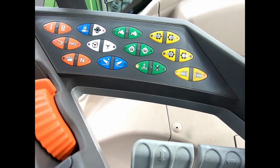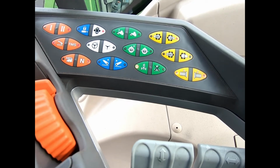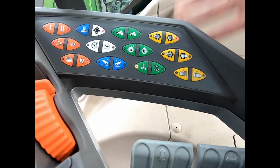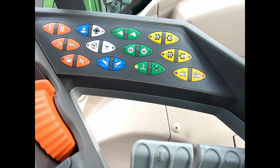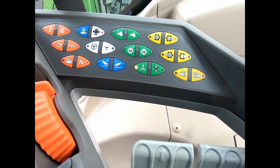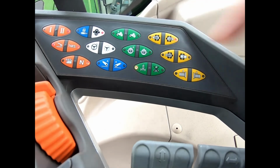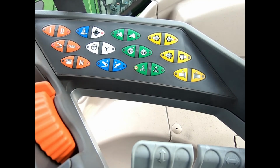And then when I jump back in, obviously I'll switch the PTO off, put it into drive, and parking brake off, and off I go, and then the lights will go out. So when I next come back in and I need to activate the stationary mode again, I've got to go through the same sequence. Make sure it's stationary, neutral, parking brake on, PTO switched off, speed selected, which always will be until I tell it otherwise, and then press and hold again to get the LED lights flashing.